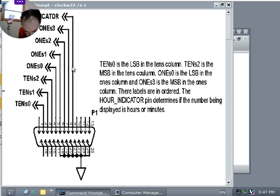Of course, there's some resistors here that are not shown. They go to LEDs. I put the resistors on the screws on that wall plate adapter, that wall plate keystone, whatever we're going to call it. That has RJ45. Why am I using RJ45 on it? It's because I noticed it had enough pins that would let me use all of the bits that we need.